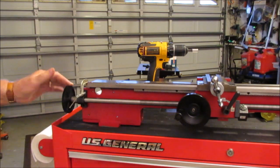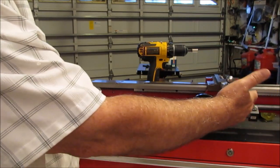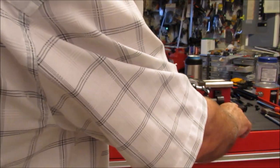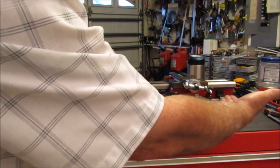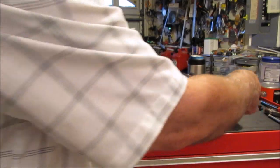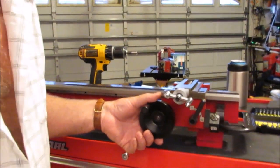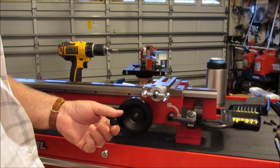Okay? So what I did was I used a hand crank. Make sure that the handle's up. Go to the rear. Loosen the clamp a little bit because the half nuts will hold it in place at this level. So go back as far as it will go, and then engage the half nut like that. Forgive me, I can't see my own hands in my own camera here.